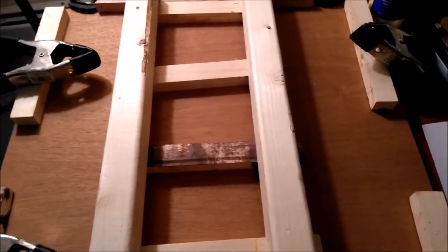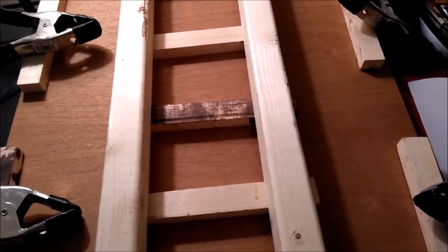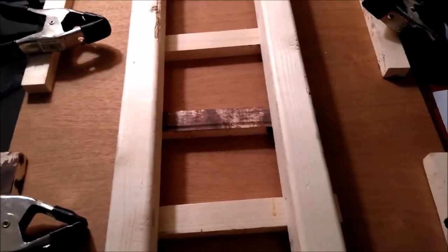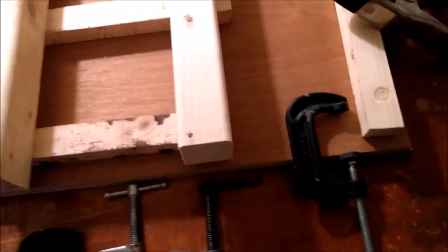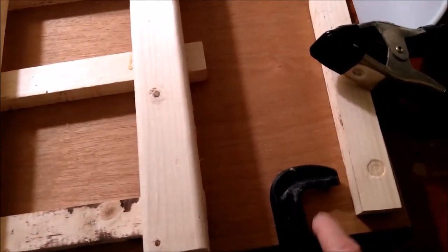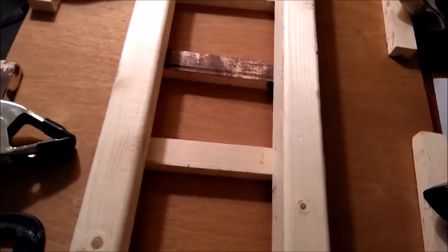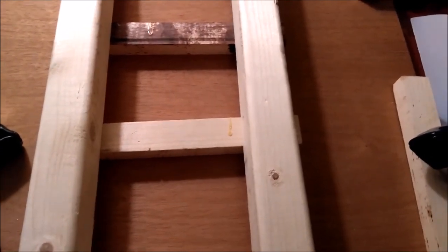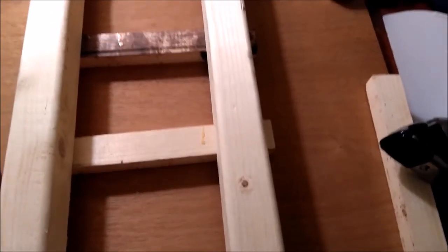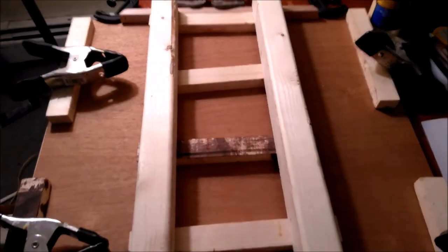This is almost 19 inches wide here, and I'm going to cut it down to about 17 to 17 and a half, where the edges are just about the right size for the width of the table. So I'm going to put some little nails in all along to completely line everything up. Maybe all I need is four, one in each corner, because those edges are going to get cut off anyway when I do the final trim down for the size of the table.